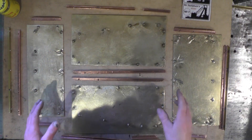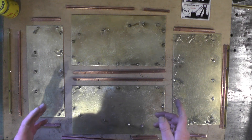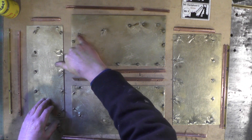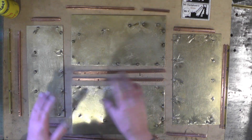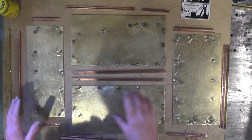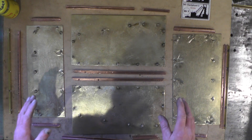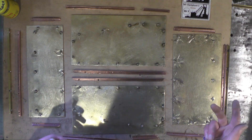I've got it all stripped down now. For anybody that's new to soldering - it's imperative that you get everywhere cleaned up, degreased and fluxed well. You can see all these dark patches around my studs at the bottom - that's where I silver soldered them on and it's still a little bit of flux left. I'm going to get my Dremel out and clean up all around the studs, polish everything up with some wire wool in the points that are going to be soldered, degrease everything and flux everything well as I assemble it. Degreasing, cleaning and fluxing is basically everything.